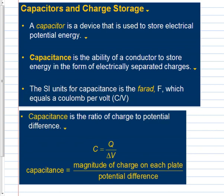Or a flash. A flash for a modern camera, not one built into the camera but a separate flash, will have a button on the back, and when you turn it on, you often hear that same squealing sound, but really faint. And then finally, a little light will come on. I'm going to talk about the squealing and why the little light comes on. It's a capacitor. You are charging a capacitor. When you push the button or turn on the flash, you're connecting it to the battery, and it begins to charge up a device called a capacitor.